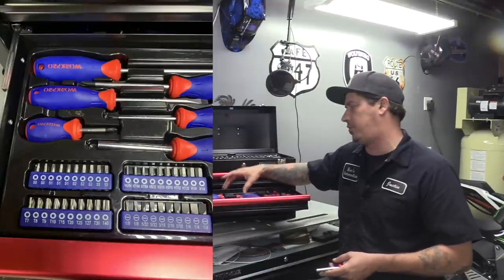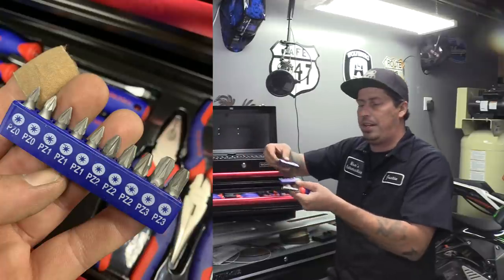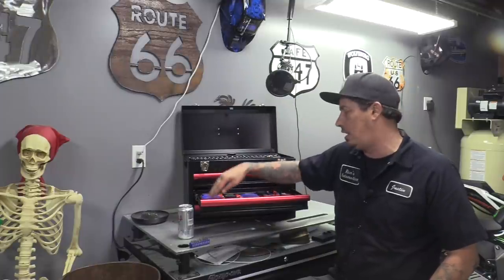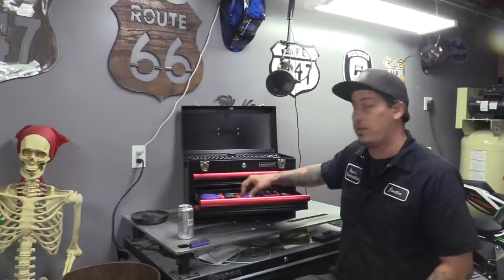Going over to the bit driver — I thought this was pretty cool because they were able to give you a whole bunch of different assortments as far as bits. But now we're getting into mechanics slash construction territory. There were a couple of bit sets I didn't think they needed to incorporate: the square drive and the PZ style. For a mechanic set, we don't use those, so you can exclude them. The Torx bits, which are widely used — we do use those, so keep those. The Allens are a perfect amount and perfect sizes. Flat heads, Phillips, interchangeable bits — all awesome. I love the comfort grip on the bit driver; it's rounded but has a slight triangular shape. Overall, this is a very comfortable driver set.